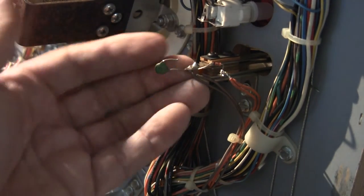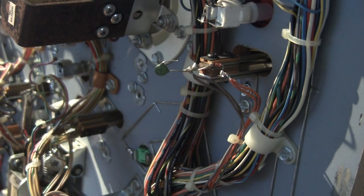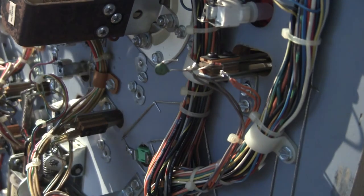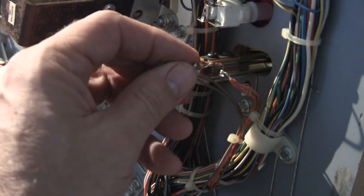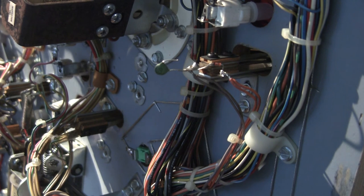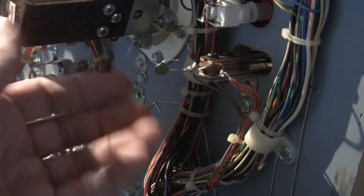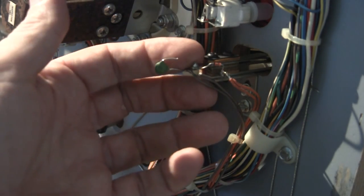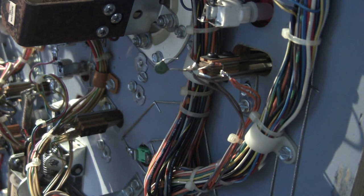So what I'm going to do is replace these capacitors on the ones that have been malfunctioning. There are a couple that are missing and a couple that might just be malfunctioning. I'll put them back on the game and get them working. They're little capacitors — a very small rating. That's what causes targets to sometimes not register. So I'm going to be soldering these back on, and that'll fix the switch not always registering when the ball hits it. Quick little fix for the game — just one of the other things I'm working on. So stay tuned for more. Thanks for watching.